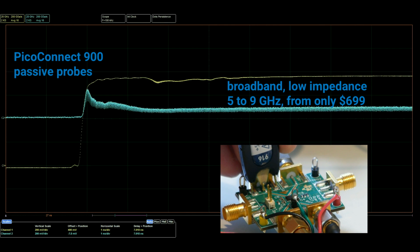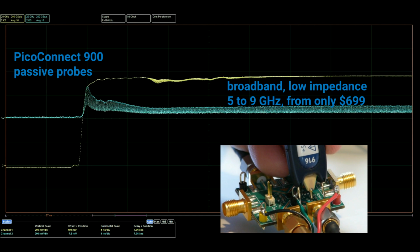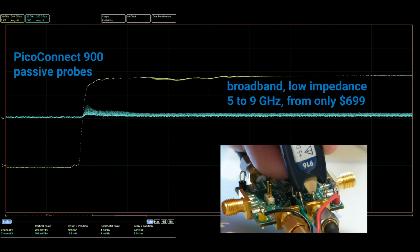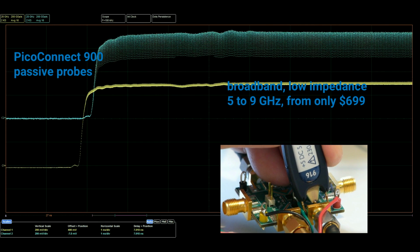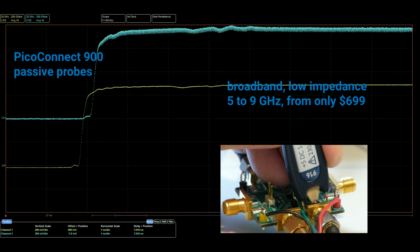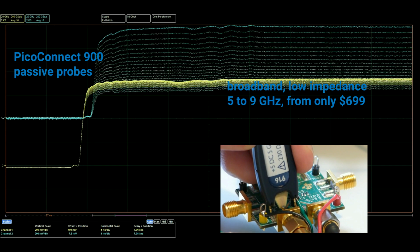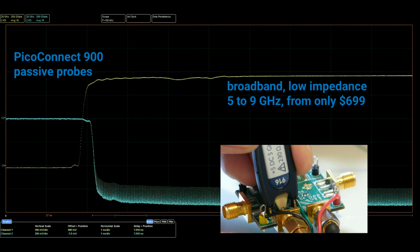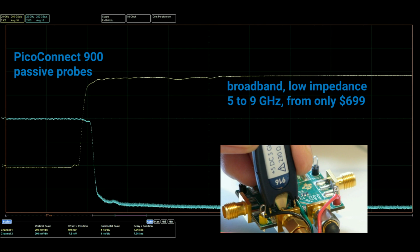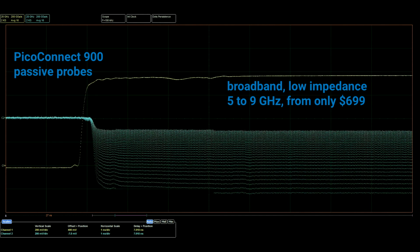We can see that there is an impact of probing the inputs on the through yellow trace. Note the considerable peaking on those inputs. Now it isn't perfect, but that is known not to be a response of the generator. When we probed the yellow trace output, we saw a small fall in amplitude due to the probe's resistive load, but notably not a substantial change of step response, due for instance to any capacitive load. The other terminated output can be probed without impact to its partner.